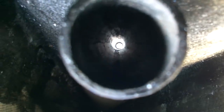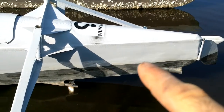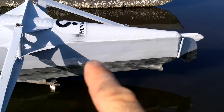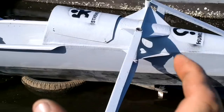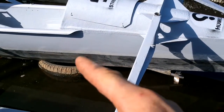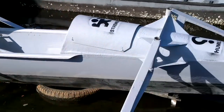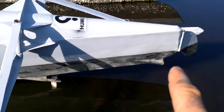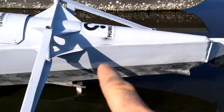This is a pretty long tube to put a steel shaft through and hope it doesn't hit the edge and slowly wear through the sides. This tube comes up inside to just under this hatch - I love how this hatch came out. So if this tube gets a hole worn through it somewhere in here, it'll flood the back part of the boat, which is not ideal. On the other one I put a bearing right in the middle, so there's a bearing in the middle and up by the pedals. This one will have more power running through it, and I have a bearing down at the end that'll have water running through it to keep it cool. But can I put a bearing up in the middle?